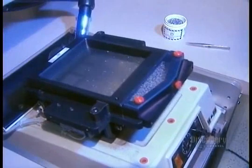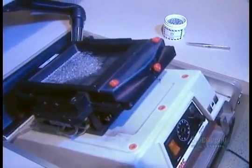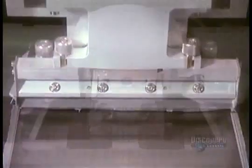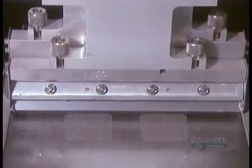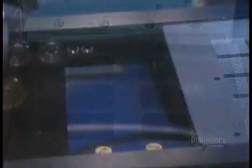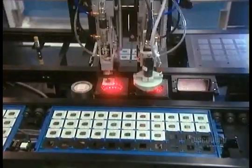The next step is to create the electrical connections that will later link the microprocessor to the computer's electronic card. They start with tiny cylindrical pieces of tin called columns. Tin conducts electricity. A giant suctioning sieve vibrates the columns until they fall through the holes, lining them up vertically so they can be attached to the substrate. A machine spreads a thick adhesive paste, then attaches the vertical columns in it from underneath. A robotic arm positions the chip-carrying substrate onto the pasted columns.